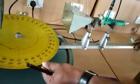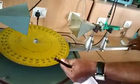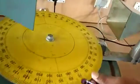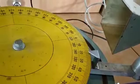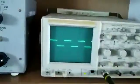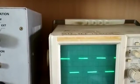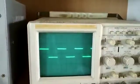We can take the similar readings on the left side also. To the left side of the antenna setup, at 5 degrees, 10 degrees, 15 degrees, 20 degrees, 25 degrees, and so on. You can observe that the voltage which was maximum at 0 degrees, now when we increase the angle, correspondingly it has got reduced.